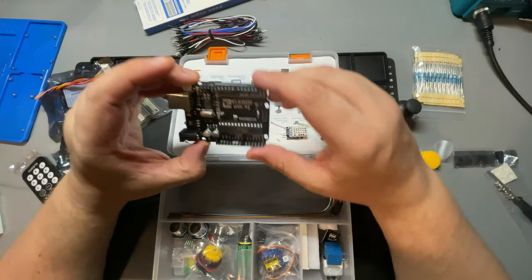So it's showing the waveforms. One of the reasons I want to get an oscilloscope is so I can see this myself. And I always thought that when you use a dimmer switch, for example, it just sent less power. But it sends the same amount of power, but it turns on and off extremely quickly. So you can see here that that one's turned on less than it's turned off. So you only get 5%, and then the other way around for 90%. So, yep,